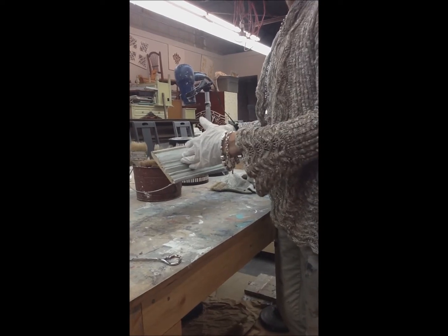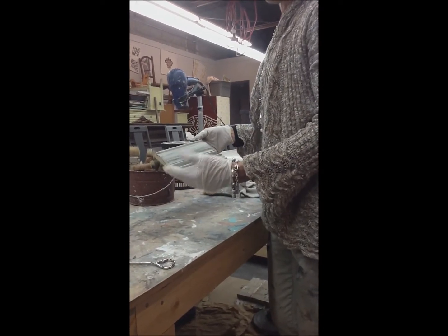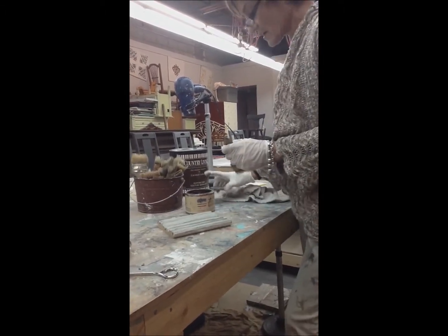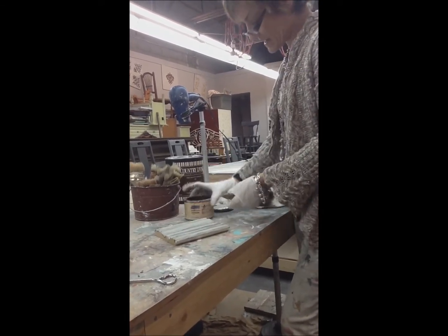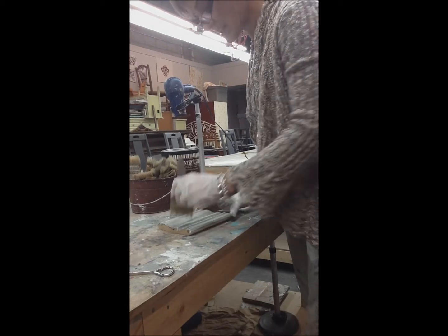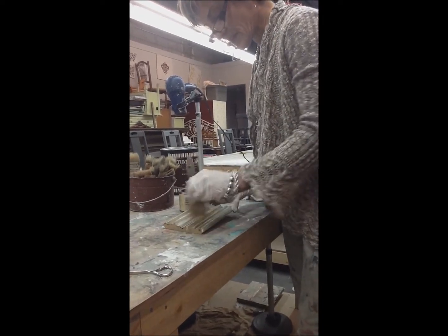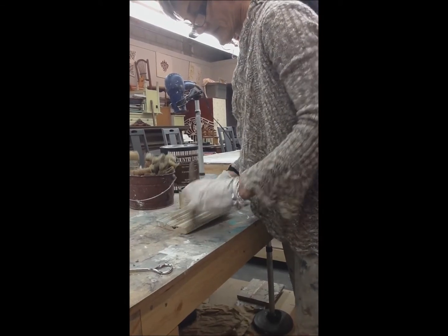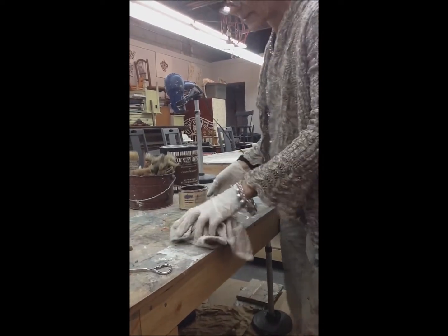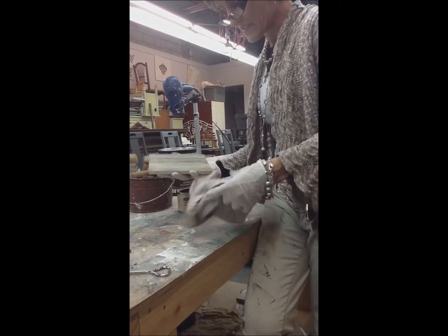It's pretty matte. If I want to pop my sheen and give it extra protection, I'd give it one more coat of top coat and I'd be good to go. I can buff it with a clear wax if I want — that gives it a nice little sheen. What I did on the furniture, because I wanted something a little bit warmer with my copper top, was I took American's dark wax, which is just like the clear wax but tinted. I scrubbed it on, and because the finish is already sealed, it just kind of goes on and gives it a warm glow. I don't have to worry about it biting in too much. I wiped off my excess and then the next day I came back and buffed it to a nice little sheen.